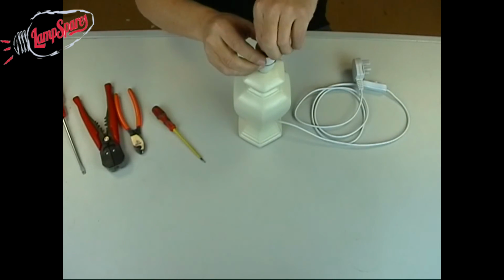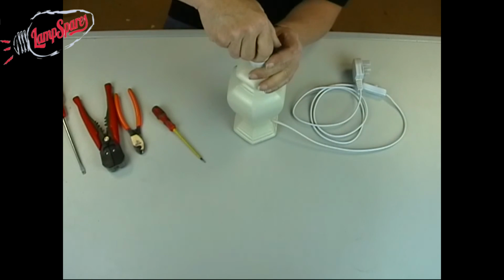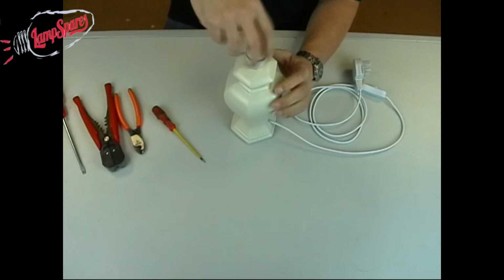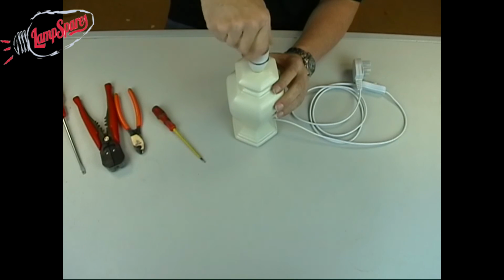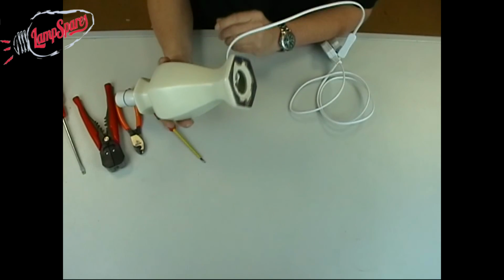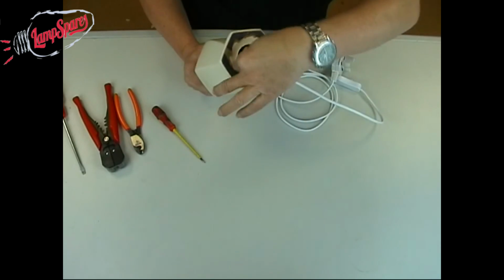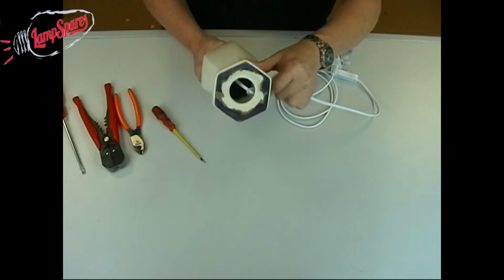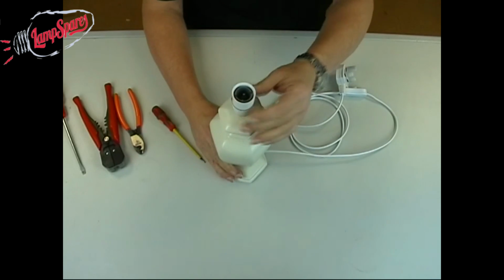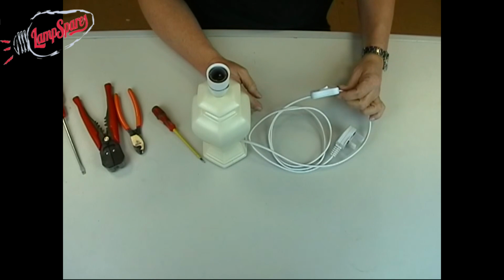We've obviously got a shade ring on here, which was just a little bit tight. So there's the shade ring on here, and when the shade ring goes back on. So that's the basic operation of rewiring this lamp. The cord grip in there, so that what we're after is the cable in here is never pulled tight on here. New bit of felt on the bottom of that if you wish, and effectively there you have rewired a little switched vase.